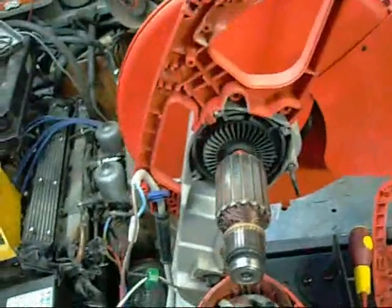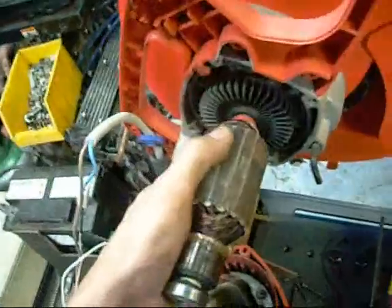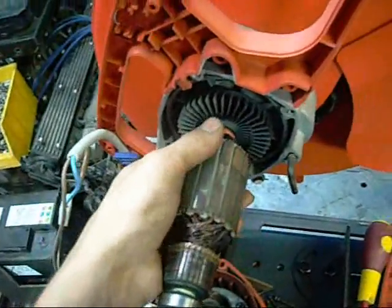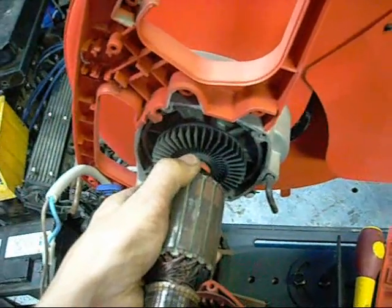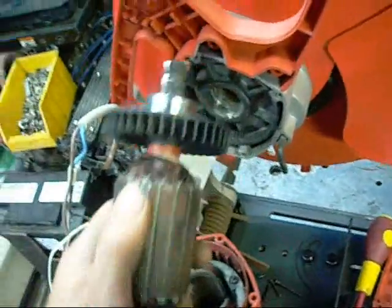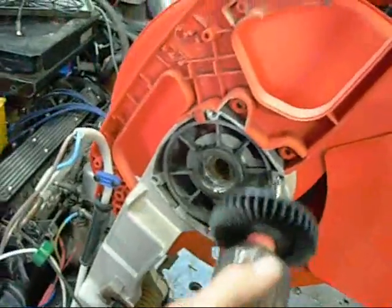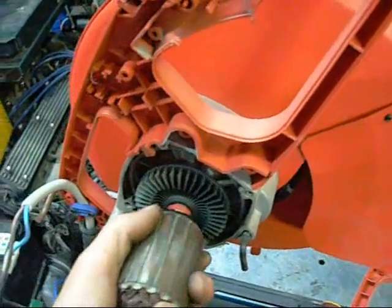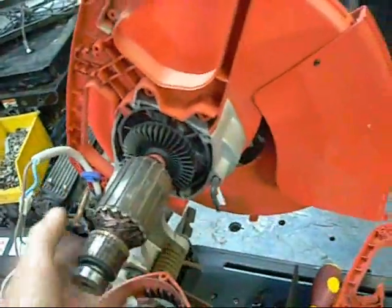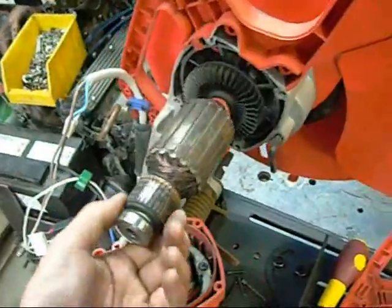Rewinding is a fairly expensive job — these saws are only $300 each, so spending $200 or more on winding one of these rotors is a bit much for a cheap saw. In which case it just goes in the bin. They did try at work to put a three-phase AC motor on it and run it off a VFD to keep the noise down. They cut the rotor through, punched the laminations off, leaving just a stubby shaft with splines, then machined a plate to attach the three-phase motor with the shaft grafted on. But it never ran concentric enough to work properly — they couldn't machine that bushing concentric enough, so the helical spindle had a bit of run-out and it clashed with the other gear inside.